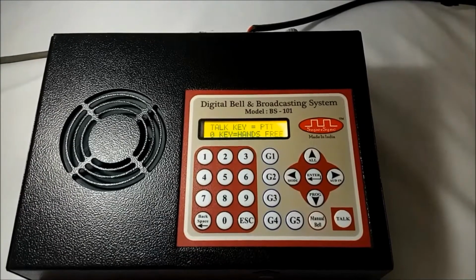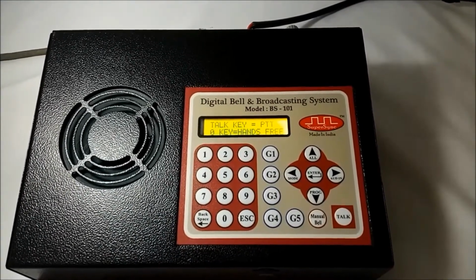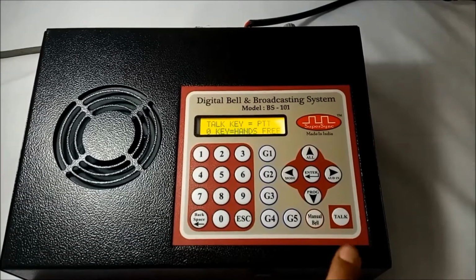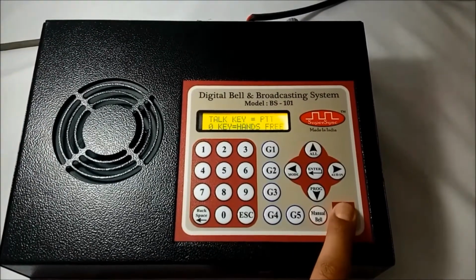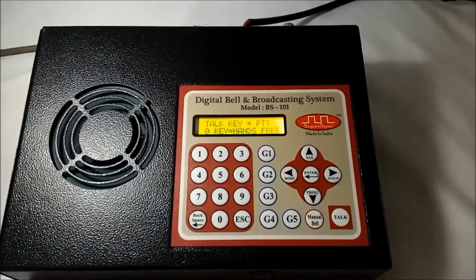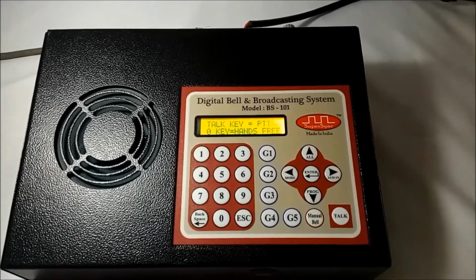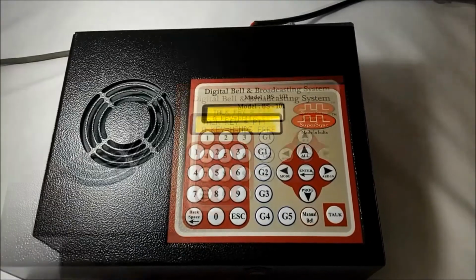First line of the screen is showing talk key equals to PTT. Here, PTT means press to talk. So, whenever I wish to speak during the conversation, I will press and hold talk key, then will wait for the screen to display speak now. Once speak now message is on screen, whatever I'll speak that will be audible in room number 5. And when I will leave talk key, my microphone will be disconnected and my speaker will be connected with classroom's microphone, like this.